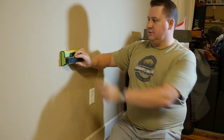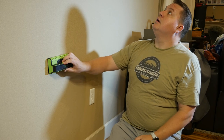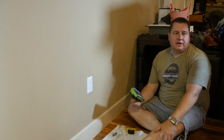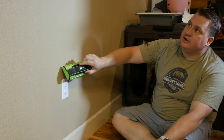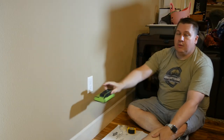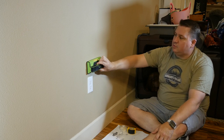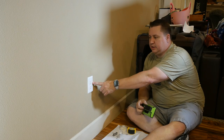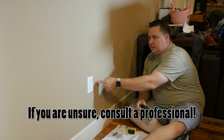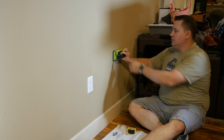We're probably getting some false readings in here because this is an insulated exterior wall. Uh-oh. Our initial assessment found that there was a stud here but a big metal beam in the wall right here that's holding up the second floor of the house — where we wanted to put the dog door is not gonna work. Be sure to look on the outside of the house as well, because when we measured there's actually an electrical outlet on the right side of this stud. So left and right has an electrical outlet, so we have to skip one stud down.